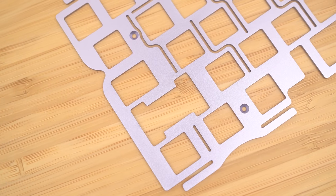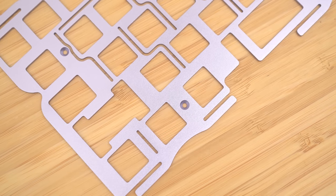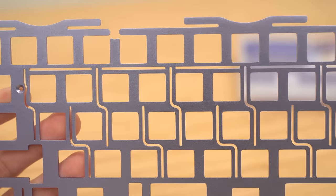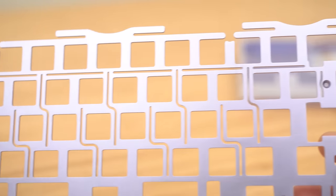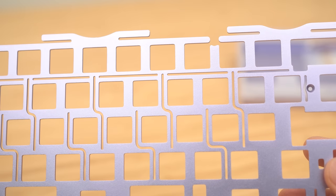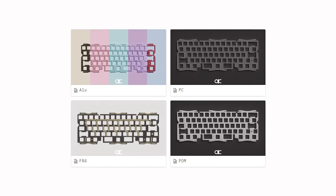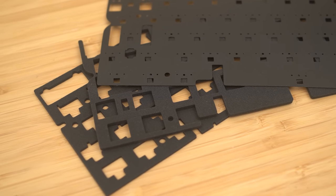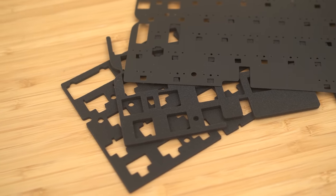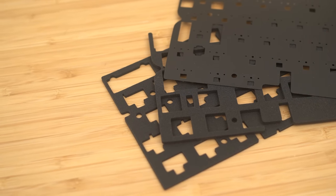Since one of the major focuses for this board is color, the QK60 can be had with a matching anodized aluminum plate to match the case. The plate has a very nice finish, the same as my lavender case. The aluminum plate has numerous strategic flex cuts to work together with the PCB and provide a more comfortable typing experience. You still have the option of going with FR4, polycarbonate, or POM plates. As with most boards these days, you get various foams like under-PCB case foam, plate foam, as well as the famous Owlabs PE foam to customize the sound.